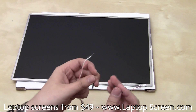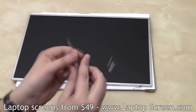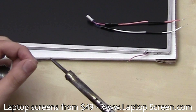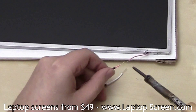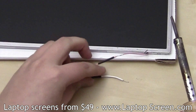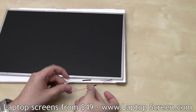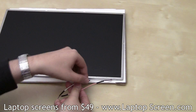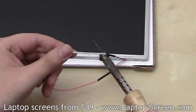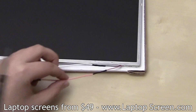I'll be using heat shrink tubing for insulation of the second pair of connections. Please note that the heat shrink tubing has to go on before completing a connection. Align your leads, and using a tiny dab of solder, attach the wires. Then swipe the soldering iron across the tubing to make it shrink in position. And you're done.